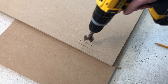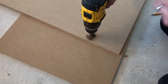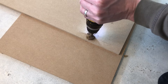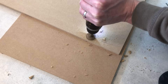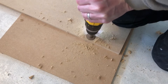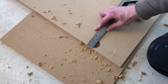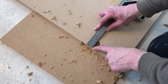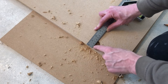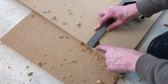What you do then is put your hinge cutter right in your pilot hole. Once you've done that, just take it slow. If you remember, it said the distance from the edge should be 4 mil. If you've measured this out correctly, you can recheck that the distance from the edge is 4 mil - or whatever your distance should have been - to check that you've got it right.